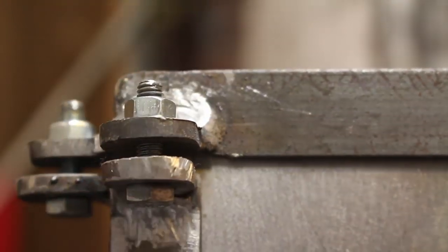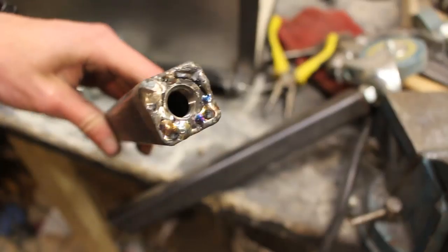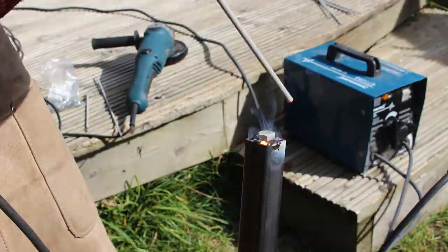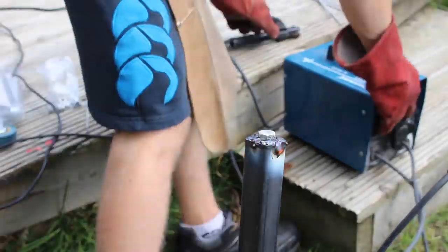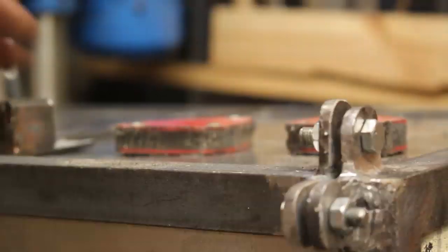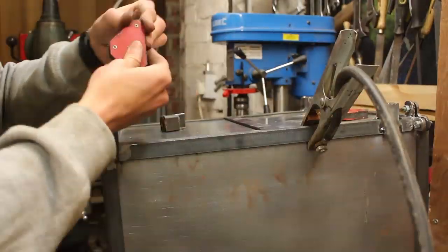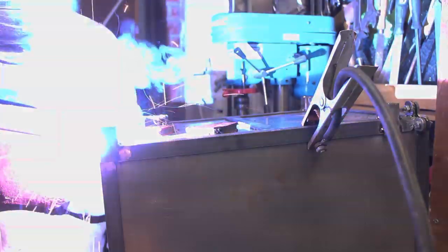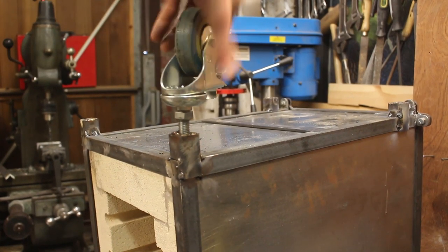I could then reassemble and bolt the frame together and that's pretty much done. I've got these casters on the end of some 30mm square steel tubing from an older project and I'm going to use these on the bottom of the oven so that it's easier to move around. These were pretty easy to make - I literally just welded in an M12 nut with some stainless steel welding rods, shortened down the rods, and tack welded them onto the frame in the places I wanted them. Then the casters can screw in just like that and now I can move the oven about because it's really heavy.